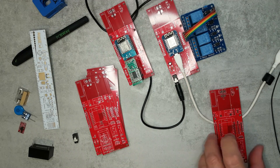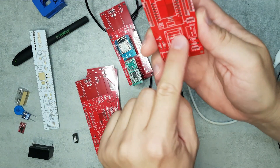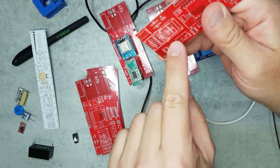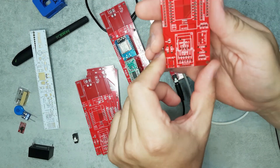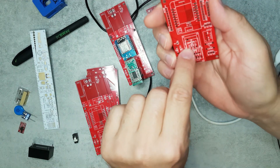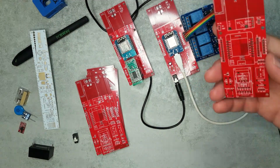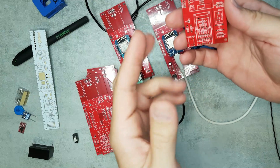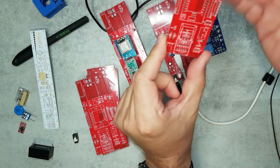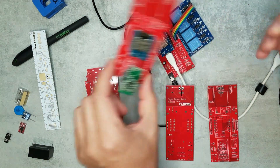In the I2C section, I had to squeeze all the parts together to avoid making a huge board, which means some footprint labels are printed on top of each other, but they're in different font sizes and still readable. It doesn't really matter which specific sensor is labeled there as long as you have the same pin spacing and it's I2C. You can also mount a sensor on the lower side if you flip it correctly — you could have one pointing up and one pointing down.